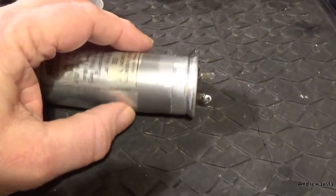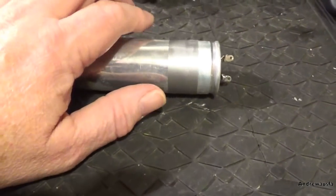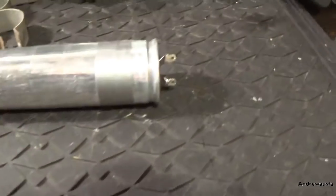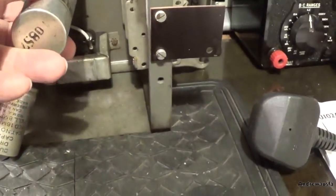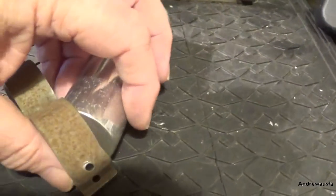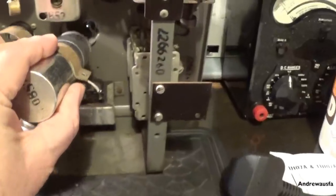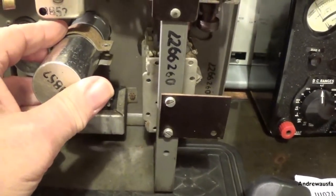It's got a bit of silver gaffer tape. If you just take a mark on the capacitor and just roll it, you'll find the length of your tape, and all I do is just put a bit of tape on there and just cut a slice off - because that's like an inch and a half diameter and you want it around an inch or less on the end of the capacitor. Now this slides into there, and once this slides over into the clamp it goes in to about there. Once that slides in there you'll hardly see that tape - it won't look out of place because you'll hardly see it.